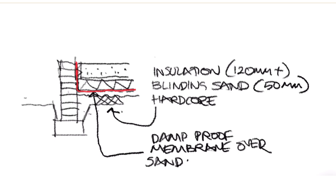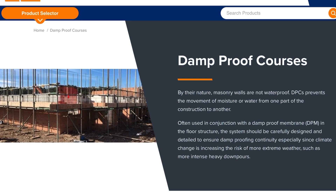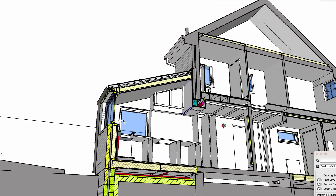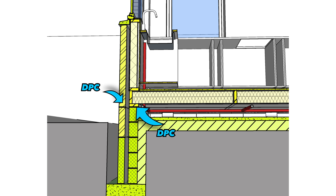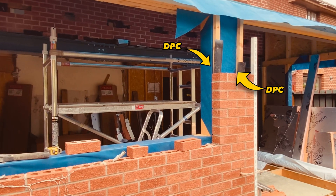Your ground-bearing reinforced slab is poured on top of the DPM. A DPC — that's C for course — comes in much narrower stiff black plastic rolls. We use these rolls around openings such as windows to stop damp in cavity walls, and along the base of a timber frame where it sits on masonry or concrete. These rolls are either 100mm wide — the thickness of a brick — or 340mm wide for ground floor masonry courses and vertical openings, or 300mm wide for cavity trays and window sills. DPC rolls are reinforced and not smooth like the DPM, giving them greater flexibility without ripping and providing a key for mortar when they sit on a brick course.